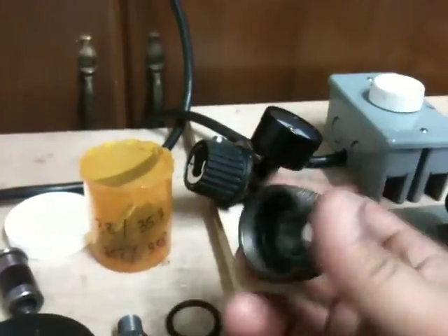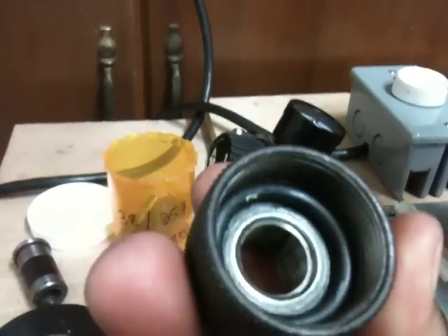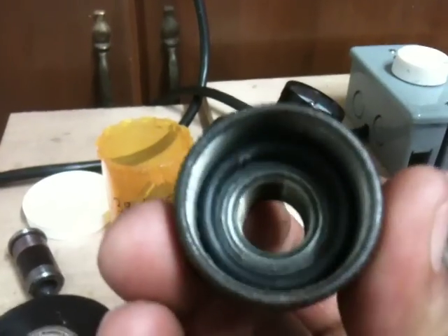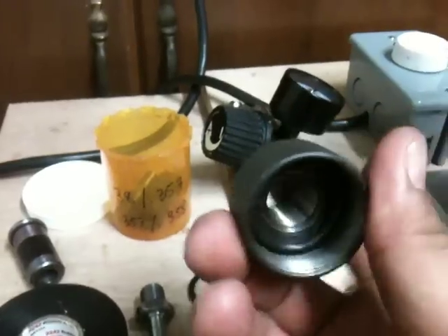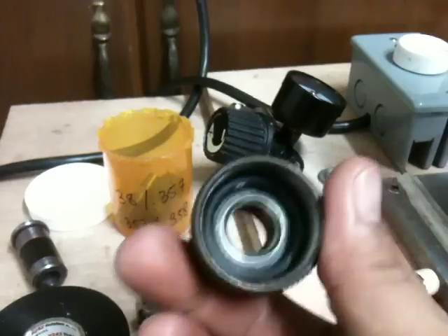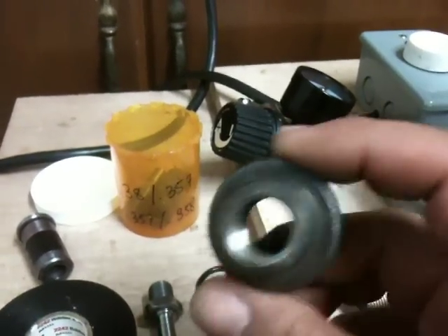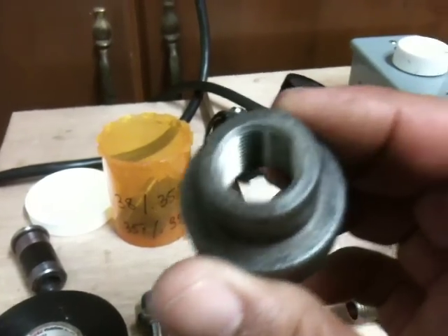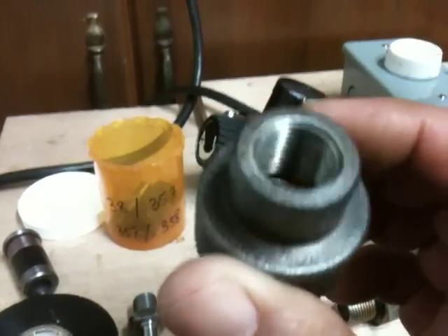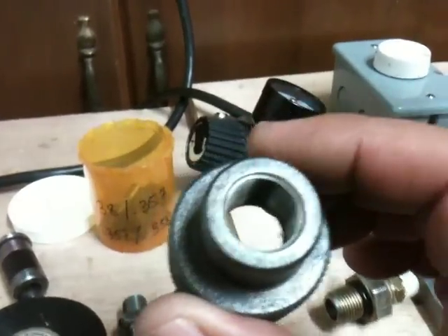Right here I have the original star lube cap. If you notice on the inside, it's been fitted with an o-ring, which you can get at any hardware store for a quarter or forty cents. This is the only modification done to the cap — you just put an o-ring on the inside. The threads on the top are 5/8 by 18 fine thread, where the extractor and the plunger rod goes.